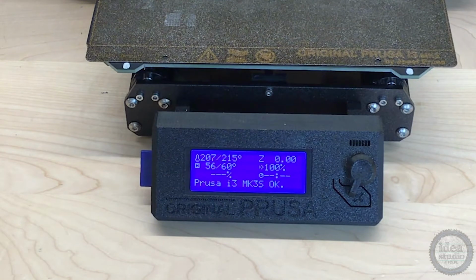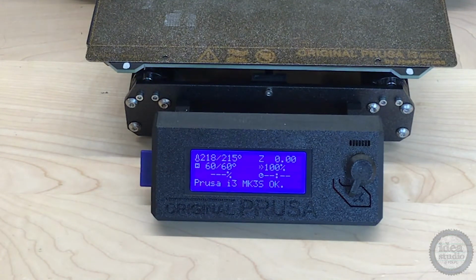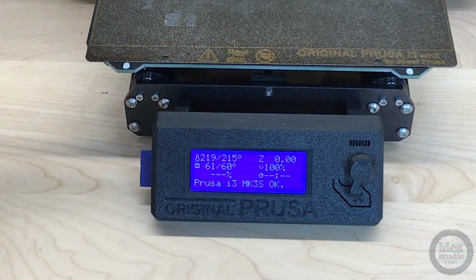It is, however, not safe for the printer to stay in preheat mode for long periods of time. In fact, there's an automatic safety shutoff. If you put it in preheat, forget about it and walk away, it will turn itself off again. So actually we're there right now, we're at 2:15. So when you come in, you want to put it in preheat mode, but then don't walk away for half an hour. So put it in preheat mode shortly before you're ready to start loading and unloading.